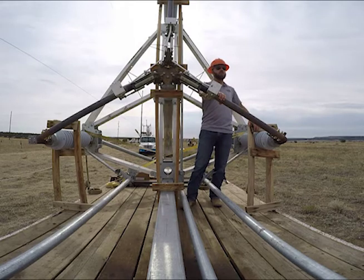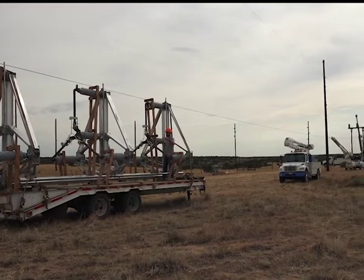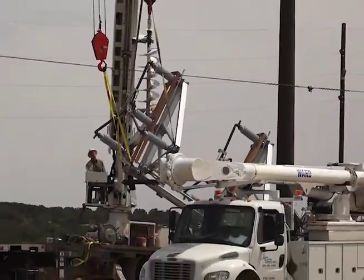The switch is set up where it's horizontal right now. We're going to move it up vertical so that we can have each of the three phases of our three-phase system go into the top center — I'm here at the bottom phase — and they're going to be fed in and then out, mounted in a vertical alignment up there on the pole.